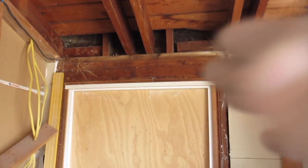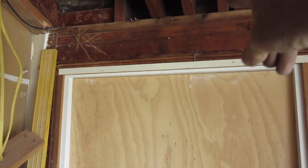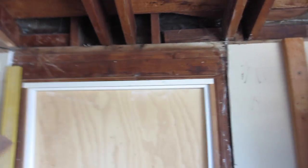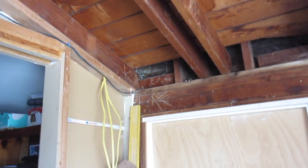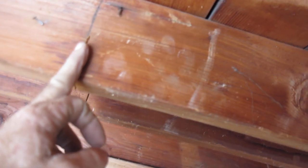You've got a window so you want to put a door — how hard can that be? Well, it's that hard. The height of that header is not high enough, so we're going to go up through the roof. The roofing is in the way from the inside, so we're going to cut it back. You can see I've already started cutting the rafters back. We're going to level this out at the height of the door — it's going to be inside the scope of that cubby that's already waterproof and roofed.